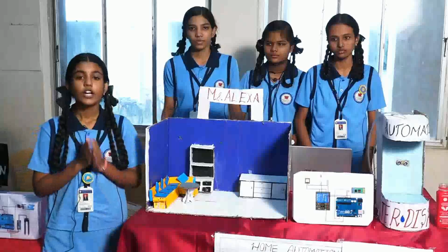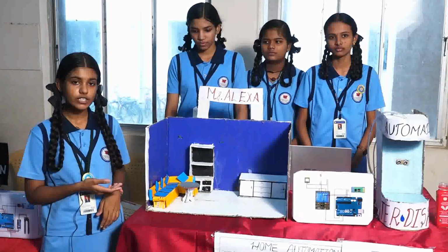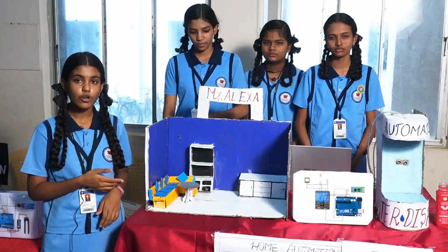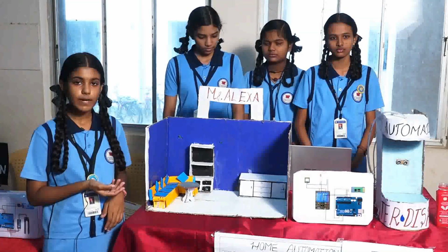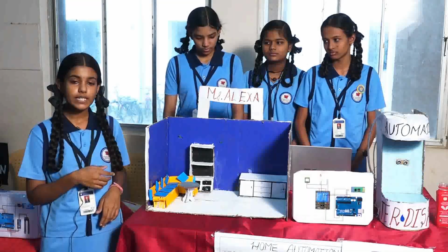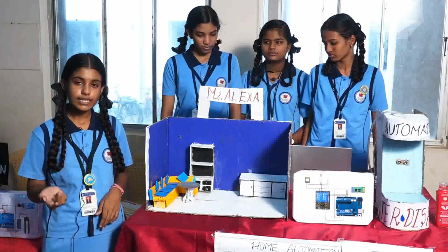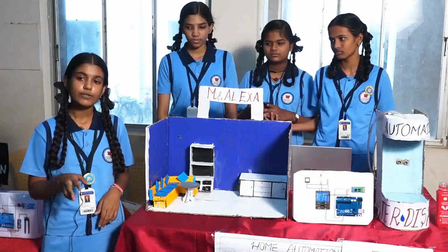Thank you. Good morning. This is our project, Miss Alexa. Miss Alexa, through voice recognition technology, integrates Arduino and Bluetooth. When a specific voice command is given, such as turn on light one, the Arduino interprets the command through the microphone. Then the Bluetooth module communicates wirelessly with the relay, activating it to switch on the lights.